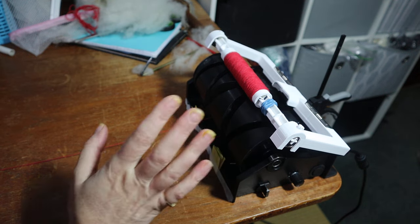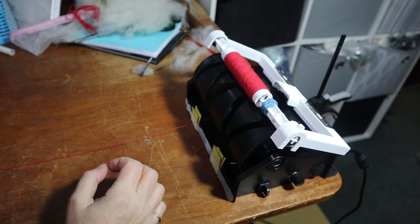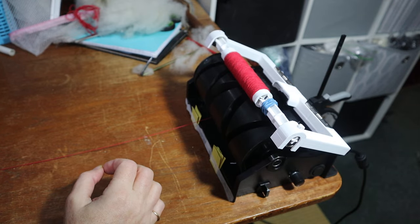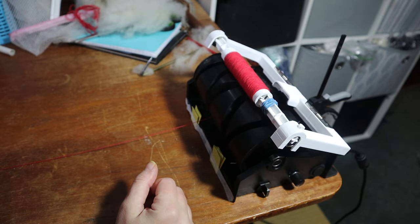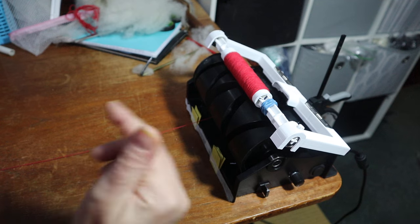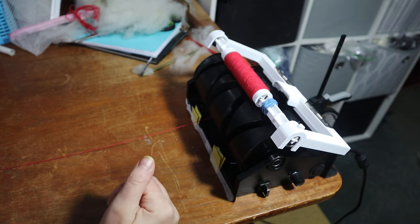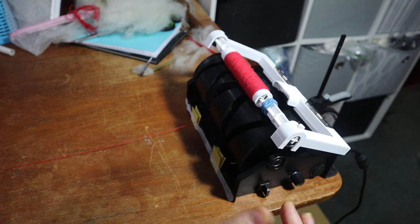With the arm, this cross part here was designed for tubes with a minimum inside diameter of 18 millimetres. This one is 16, so as well as changing the parameters, Maurice made it very easy for people to change. I did have to go back in the history of the file and make this bit smaller, but it wasn't really that much work.